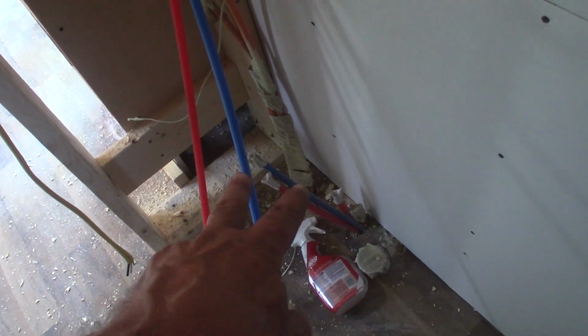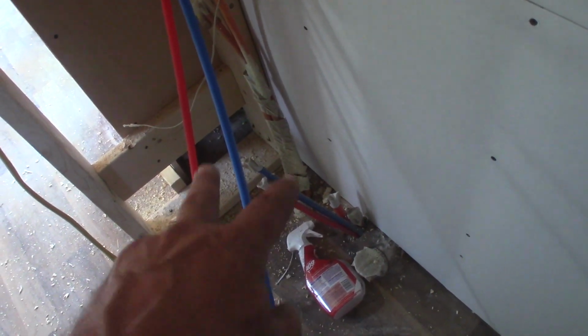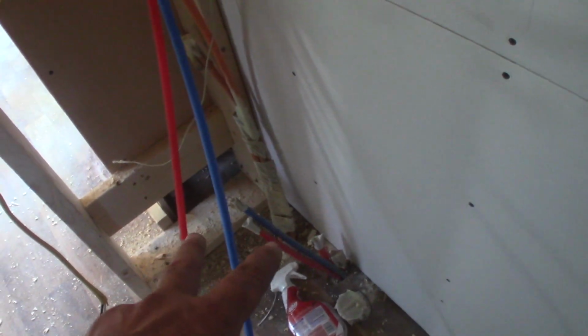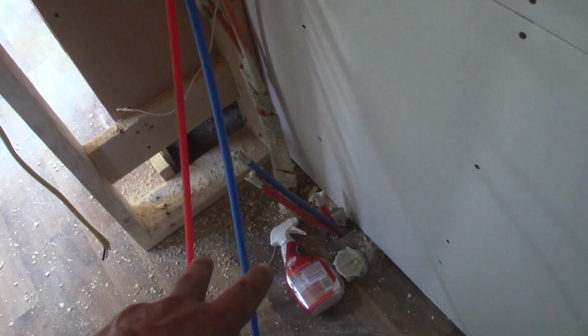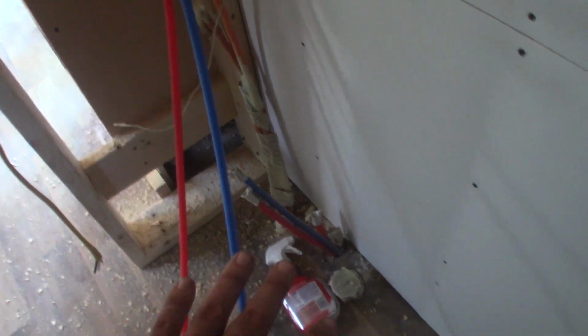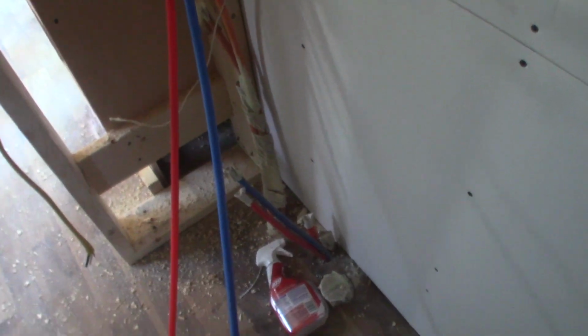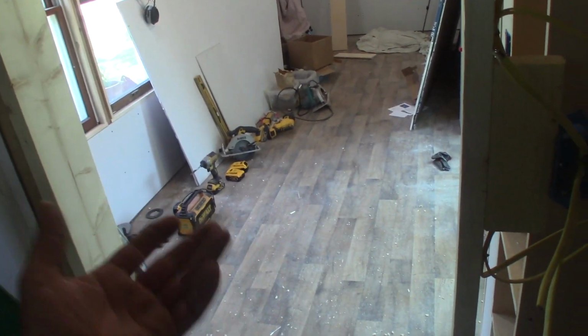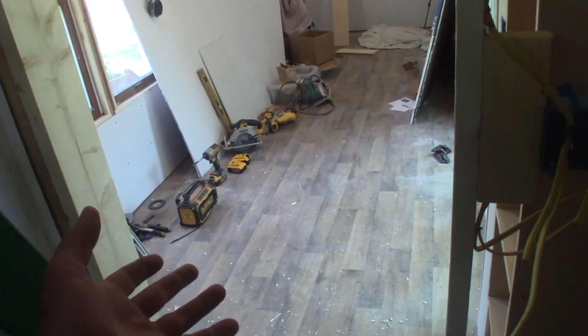I've got radiant floor heat there, which I probably won't hook up because I don't know what's gonna happen in the winter and I don't want water in the floor and I don't wanna be a slave to heating the place. But I am gonna set it up so it's done, and then if I decide to heat it in the winter, I can just hook it into the boiler, and I'll do that in the basement. I'll have to do a mix down valve, send tempered water out here because it's a concrete slab. I think it'll take hot breath to heat this, so I'm not really that worried about it. I might just put a little electric heater in here, not worry about the radiant floor, and only heat it when I really need to. So that might be the plan.